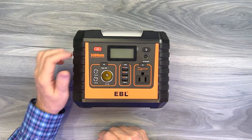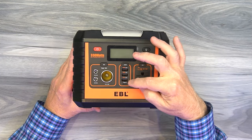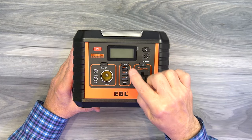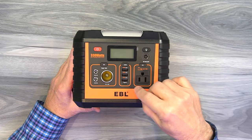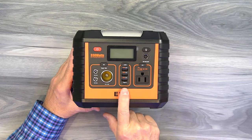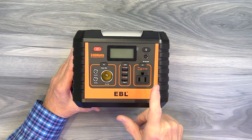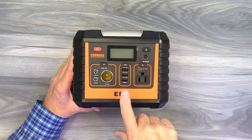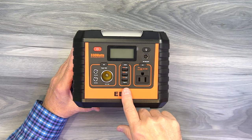The 5521 barrel connector is a standard in the industry — there are cables available to convert it to most charging cables for laptops, portable DVD players, and other devices, or conversion cables to turn it into another courtesy outlet so you can have three separate DC outlets. The USB section in the center has three full-sized USB-A ports that are QC enabled, and a USB-C connection with PD Power Delivery at 60 watts — perfect for Apple products, game consoles, laptops, and larger tablets that require extra current.